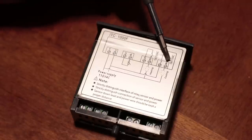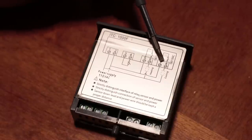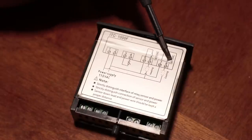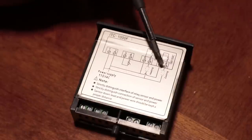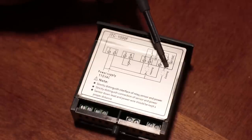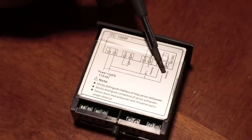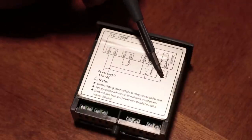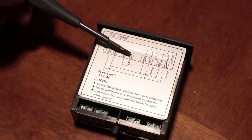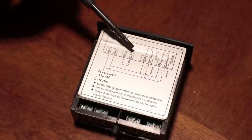We're going to be using the cooling side for the keezer, so we need a power wire that also supplies terminal number seven. You can think of terminal number seven and number eight as a switch — signified by the little break in the line — that turns the power on and off to the cooling circuit. The cooling dotted circle signifies your keezer or refrigerator. We'll also need a neutral wire on the other side of that circuit. The temperature sensor goes into terminals three and four.